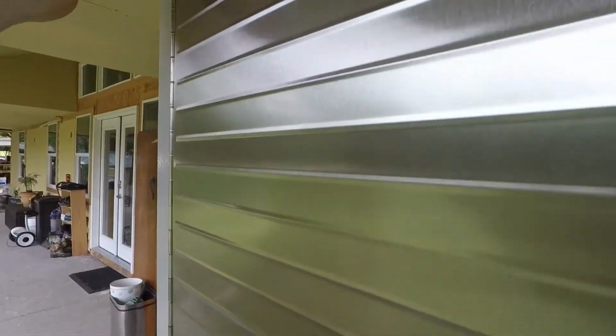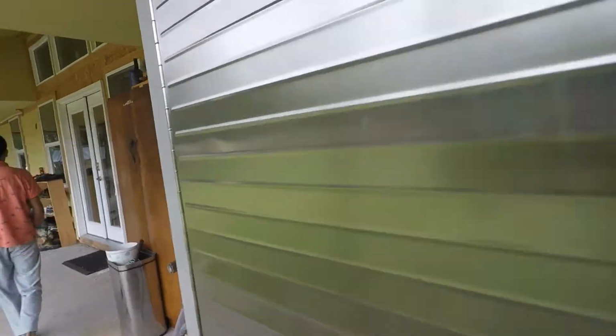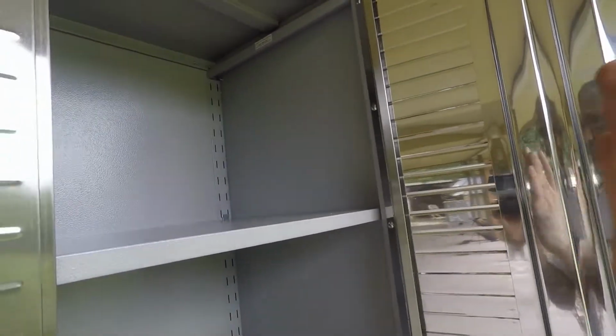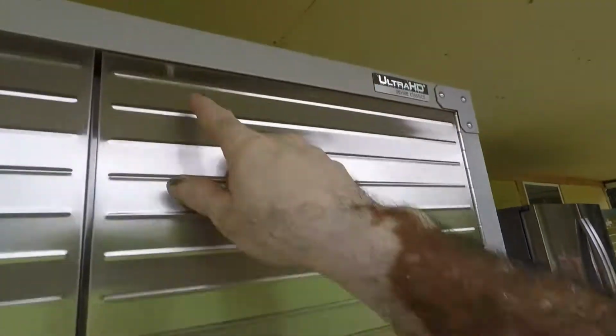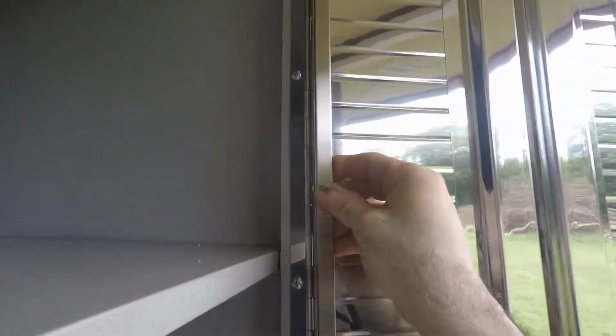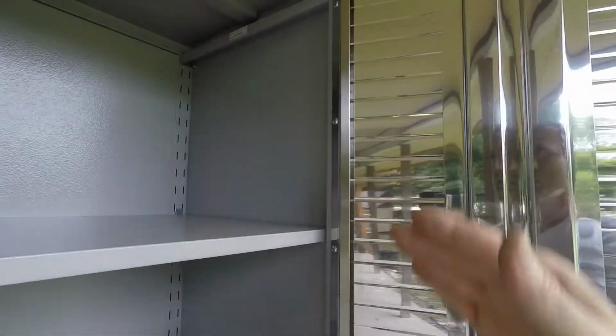Another thing to make sure of when you assemble these doors: they have a little bit of play in them, so you can lift them up and down. Before you tighten these screws, push the door all the way up to the top, and as you tighten the screws it's gonna drop down and create a little gap, which is what you need. Don't try to line up the door in the exact middle, because that's what I did and it didn't quite work. See, this one even dropped more than I would have liked. But the point is, lift the door all the way up and then start tightening the screws, and it will drop a little bit because of the weight of the door. And as you tighten the screw, it's gonna turn the door downward. It's both ways, so that's the reason you want to do that.